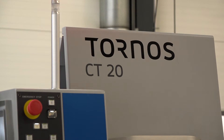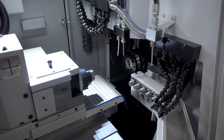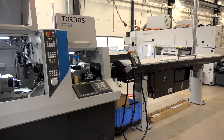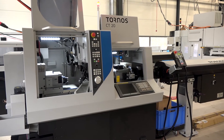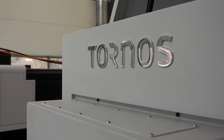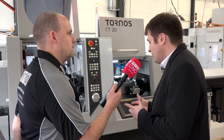It's also easy to access, change tools, and quite tidy in its appearance and footprint. Some 20mm bar machines can be bigger, but this is neat and compact. That was actually the objective — a really small, entry-level machine to serve customers with a worn-out old CNC they want to replace, or customers switching from cam-driven machines to CNC but whose workspace is already crowded and short on space.